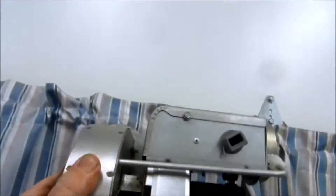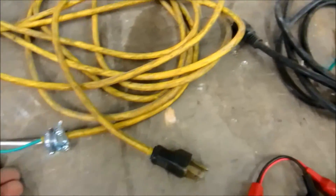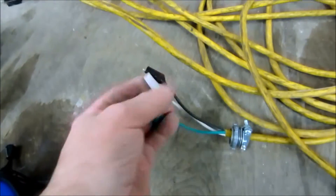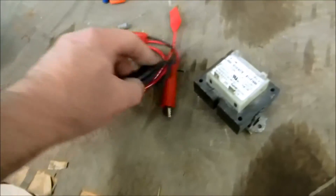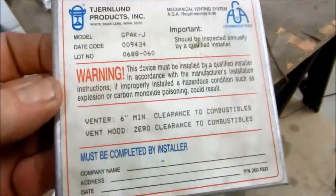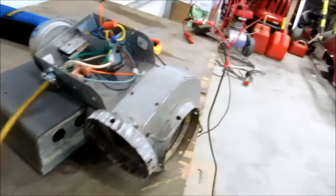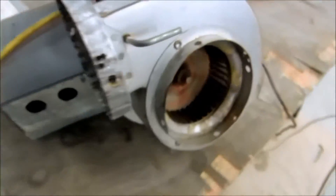Usually they're up against the ceiling where you can't get to them. For jumpers I just use these extension cords with little alligator clips for quick connections. I've got some of these 110/24-volt testers I use a lot. This is an old-style 24-volt one that was on a furnace I took out. I'm just going to wire it up here and show you how it operates.